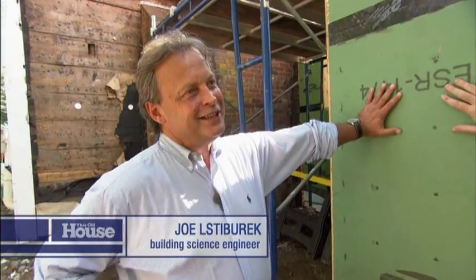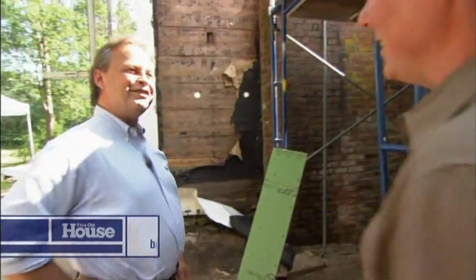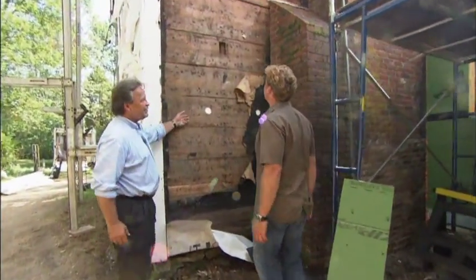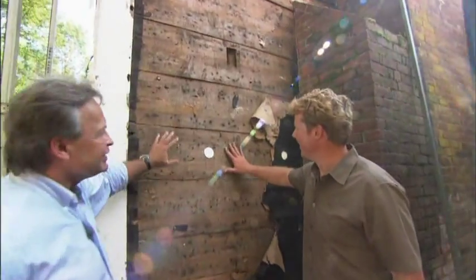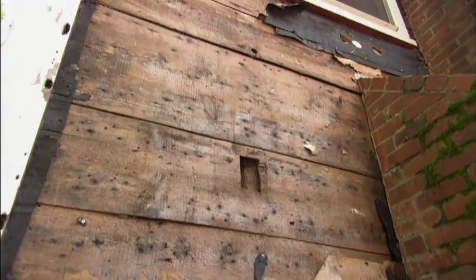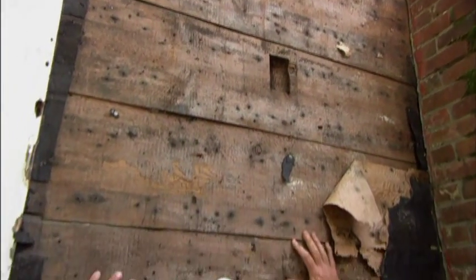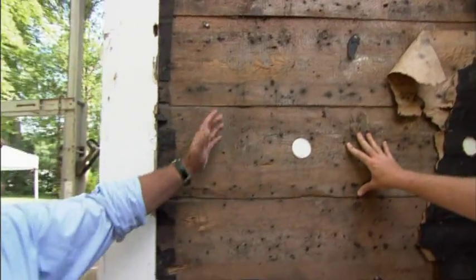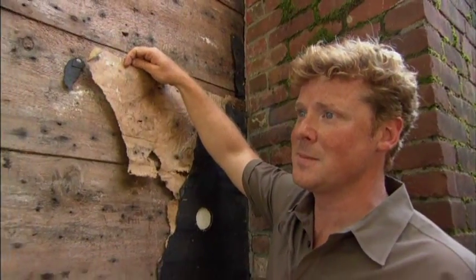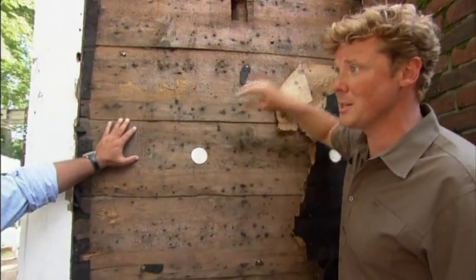Keep the water out and keep the air out. But we've been doing that for centuries. We've been doing it differently over 300 years — we're getting better at it. Well, we didn't do anything 300 years ago. We built with 1,000-year-old pieces of wood, and it was okay for them to get wet as long as they dried, because these walls were completely uninsulated. Then a big improvement was putting rosin paper over the cracks, so the air didn't blow through your house — and that increased comfort.